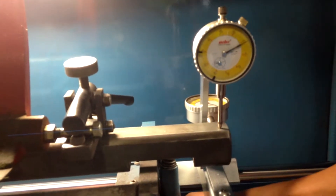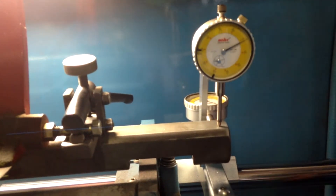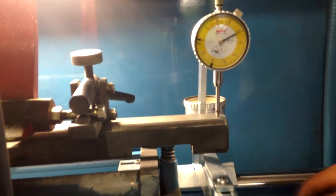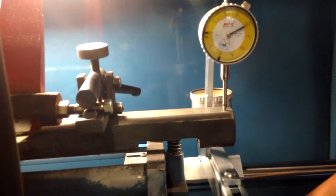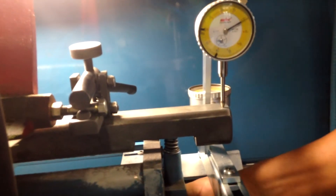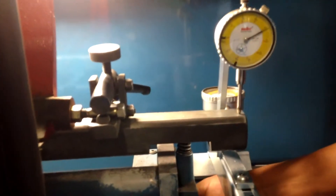What we do is turn that adjustment a little bit past — maybe a thousandth or two — because once you tighten it back up it will come back to zero. It's really just fine-tuning how many thousandths you need to be past so that when you tighten it up it comes back to zero.